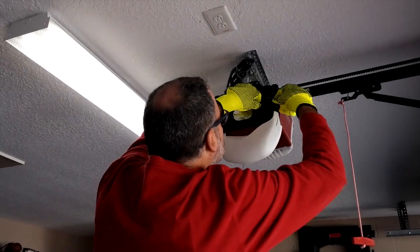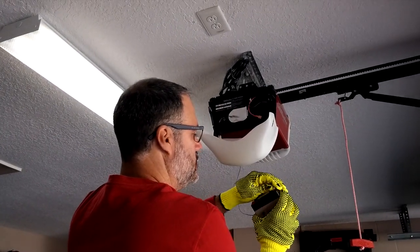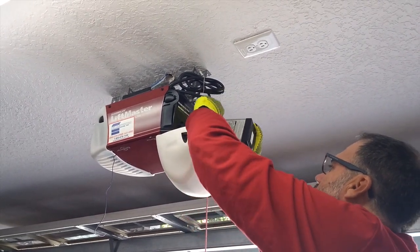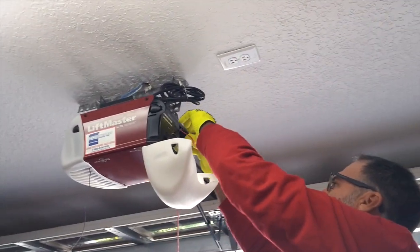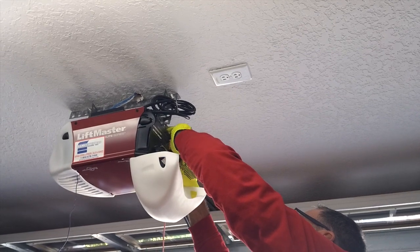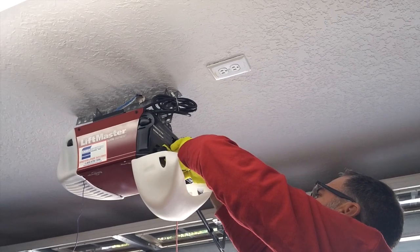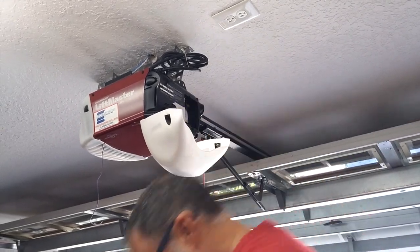Alright, here you have the wiring. Okay, positive and negative. Then on your new battery, you have to remove these clips that are protecting the terminals. Alright, so make sure that you put the negative terminal on the top, like this. Put your battery inside the case, and then negative with negative. And then positive. Okay, and now you put it back.